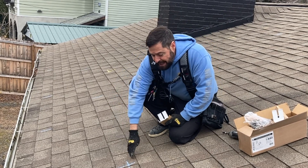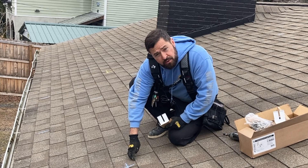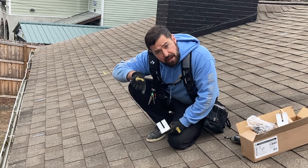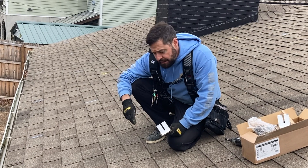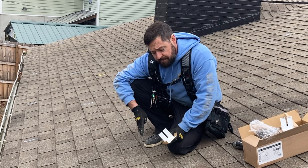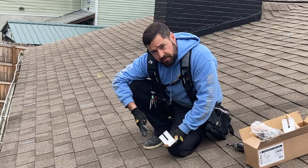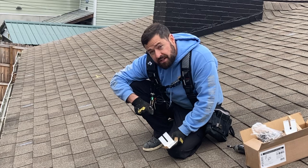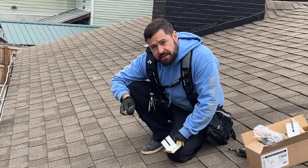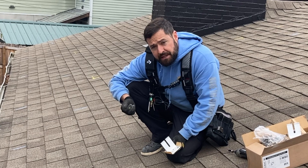Next, for flashed feet, you've got to pry up the shingles. A lot of times the flashing is going to hit nails on the next row up, so you've got to pry those nails out and pull them out. And all that really just damages the integrity of the roofing system. You're removing nails that hold the shingles in, and you're oftentimes going to break your shingles or rip them. At that point, the flashing is really, in my opinion, a little bit useless.